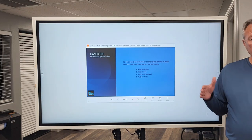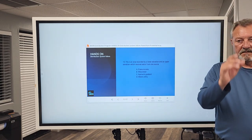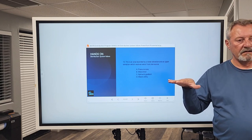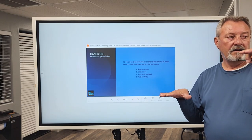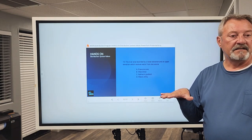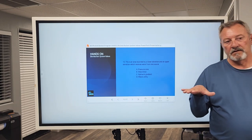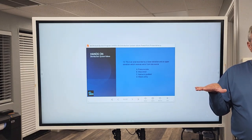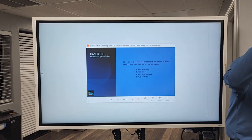Because we have a system that's at a lower elevation than the other part of the system, we call that a pressure zone. We want to maintain pressures. And really, that limits the pressure that we can provide to the system that's upstream or at a higher elevation. So we limit that pressure down there. And unfortunately, we've got to be around 85 PSI to deliver 50 PSI at the higher elevation.